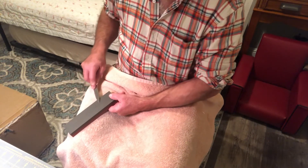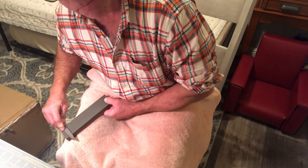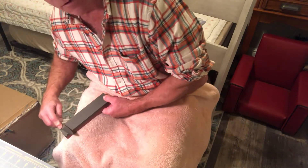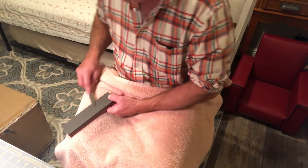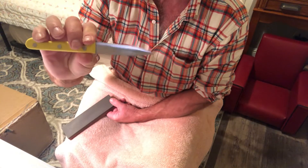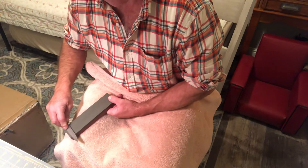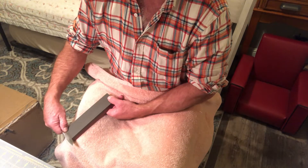So we're going to take our body down to the stone. As we go down, we're going to let our elbow go out, and that allows the blade to stay flat on that stone so every part of that edge is being honed. Then for the return stroke, stop before we get to the end of the stone. Turn the blade over like the ignition in our car. Put our thumb on the blade.